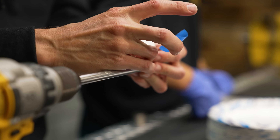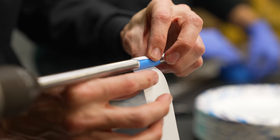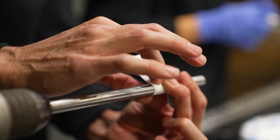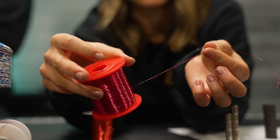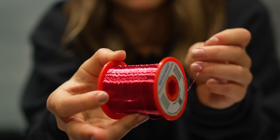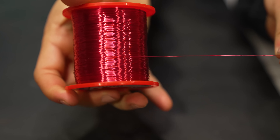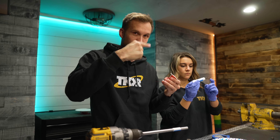I'm going to start by taking this piece of printer paper and giving it about two wraps around this steel bar. With that first wrap complete, I now want to do a second layer around that first layer — that first layer is going to act as a spacer, just there to create a gap between the size of the second layer and the bar itself. My next step is to get some of this enamel-coated wire. This is copper wire that's been painted red. That paint lets you see the wire better, but it's also not electrically conductive, so if the wire is touching itself, it's not going to send electricity across the point where they're touching — all of that electricity has to go all the way around through the wire. It can't shortcut from wire to wire.